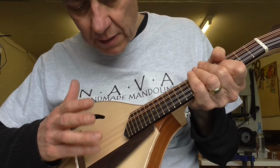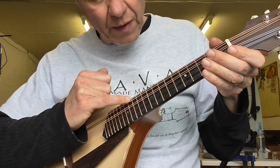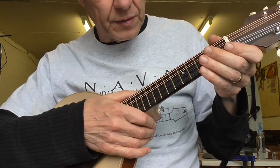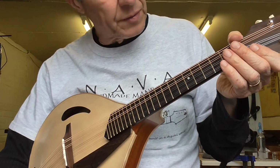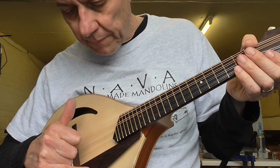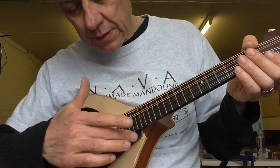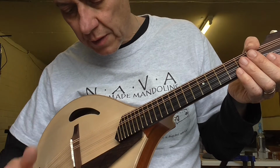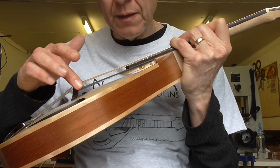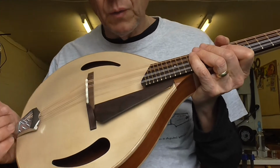Anyway, yes, the fretboard, Brazilian rosewood, wide Evo fret wire, slight camber, that's the way I prefer to do it. And certainly everybody who plays my instruments seems to like that. The finger rest is floating, it's just attached to the fretboard extension, so it doesn't actually touch the soundboard. And it's very thin, but very rigid. The reason for that is that this is laminated with carbon fibre.